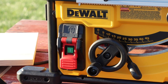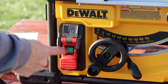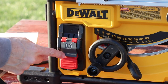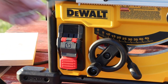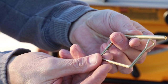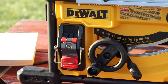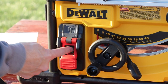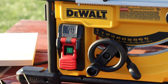The on/off button on this is one of the best I've ever seen — you can start it right there and just shut it off by tapping that red button. Another safety feature I like is a fast brake, and this also has a flip-down locking system so you can put a skinny padlock on it. I have a cotter pin here to demonstrate — you can lock it in case you have people in your shop you don't want using the table saw. Another great feature: it has a power loss reset button, so if you trip a breaker it will not accidentally come back on — you have to hit the green button.